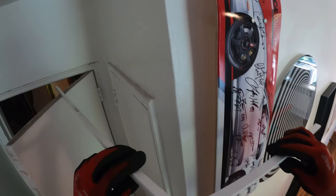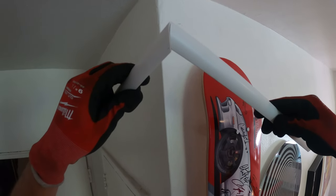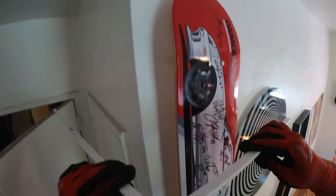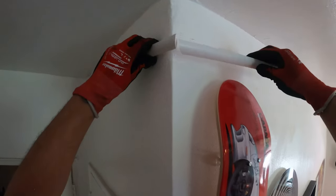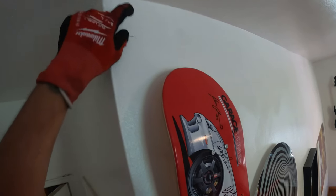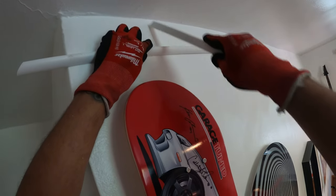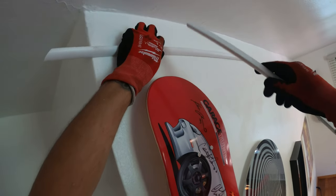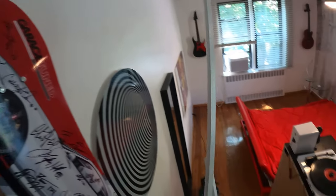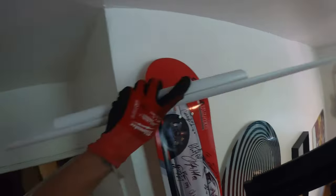I made some cuts to make a corner. We make 45-degree cuts, so two 45s equal 90, and that's how it's going to go along. I marked four inches from the ceiling because the light is going to go like this so we have some space for the light to illuminate. We're going to take the brad nailer and start mounting this.